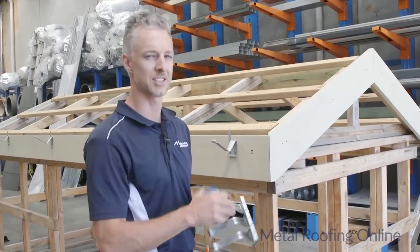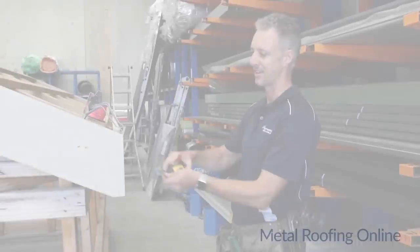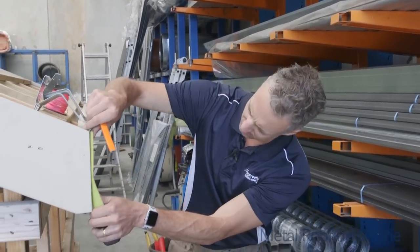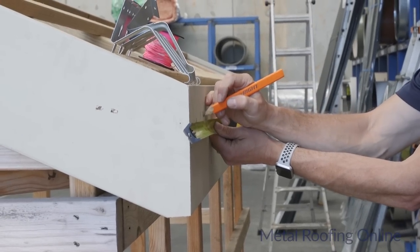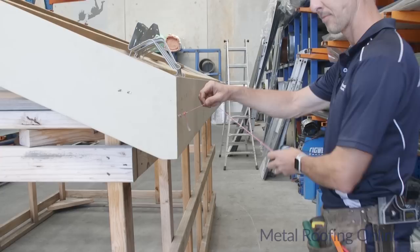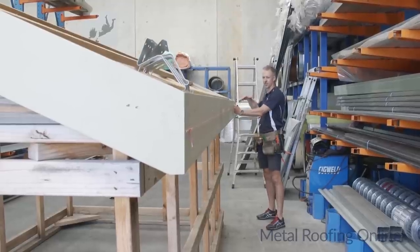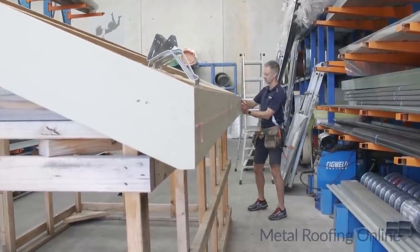We're going to do basically the same thing on the other side, because this is a gable roof and obviously requires gutter on both sides. The downpipe is again at this end — a carbon copy of the other side. We're going to make our low point here 90mm, and our first gutter clip will be 210mm from the end, the same as the other side. The high end will be 70mm so the gutter clip doesn't exceed the top of the fascia. Make sure that string line is nice and tight, especially over a long distance — you don't want it sagging at all, because that will affect the guttering you put up.